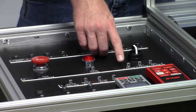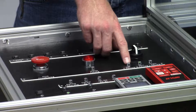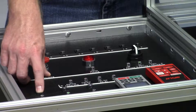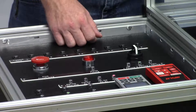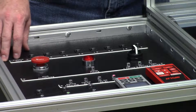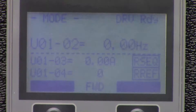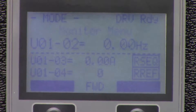If we were testing a 24-volt input card, we would want to make sure that the selector was in the 24-volt spot. Since we've verified that, let's go ahead and hit the input card power switch — this is powering on the drive. This specific drive has a safe disabled circuit, and we want to verify that when you toggle that switch on it enables the drive, which it does, so that's working properly.